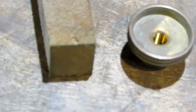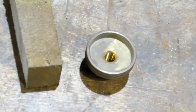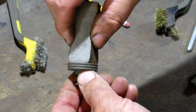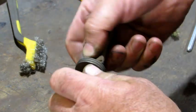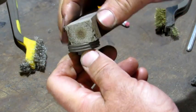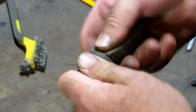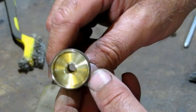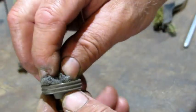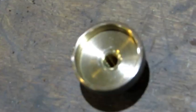For the one I'm going to clean all the way, I'm going to use a piece of sanding sponge that I cut down smaller on my bandsaw. I'll clean the recess area first — take the sponge, fit it into the recess, and start turning it back and forth. Check it often. You can see it's already starting to look better. Work it flat and push it in. For the outside edge, keep rubbing and turning the whole time. Once the recessed area looks how I want it, I'll take some steel wool and finish it off the same way.